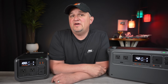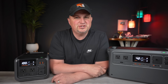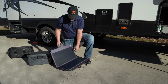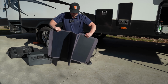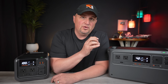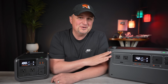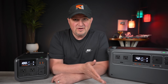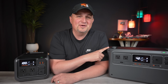You can charge it in about 5 hours with the optional car charger. And of course, it can also be charged with solar power. The Power 1000 can take in up to 800 watts of solar if you use the optional adapter and both SDC ports. Each adapter can handle 3 panels, so you could theoretically have 6 panels hooked up to this thing, up to 800 watts. If you have enough panels, or a big enough one, you can really put a lot of power into this thing.